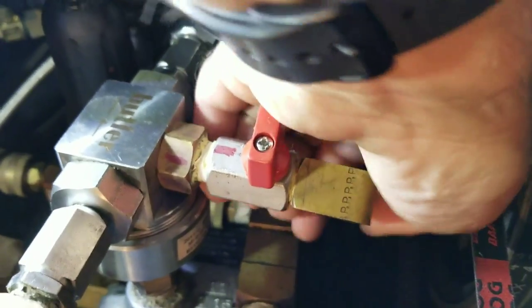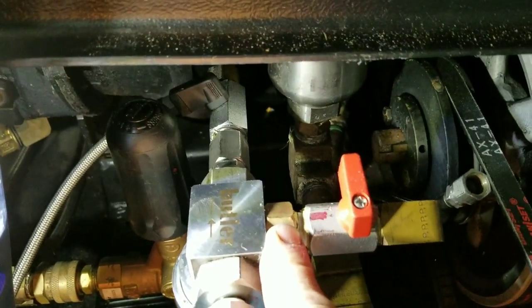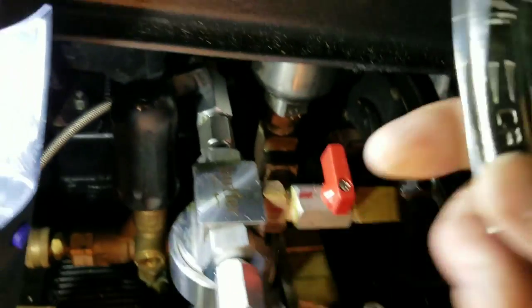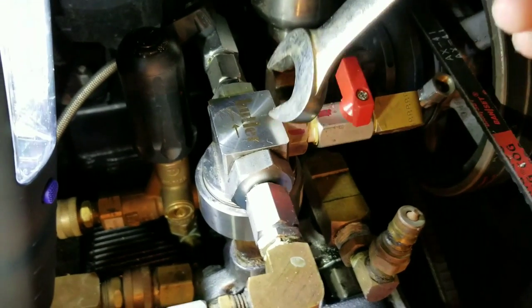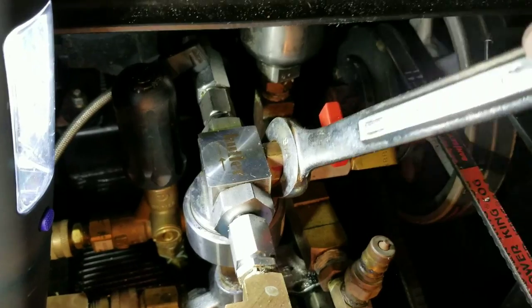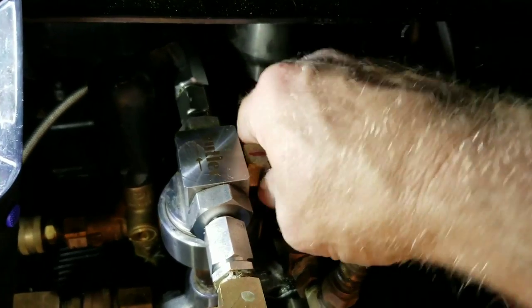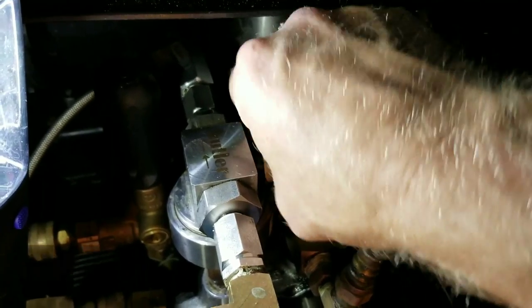That cable there - that's a bleeder valve. Now the most dangerous part here: you want to take a wrench on there and loosen that. It is a 7/8-inch wrench. You only want to - when you put this back on - really want to just finger tighten it because you'll break this. So we're just gonna loosen it and spin it off. This is a rubber o-ring on the inside here, so you don't have to use teflon. Notice how loose my pump is - it won't be like that when you take it apart, trust me. I finger tightened and put everything back together just for this video.